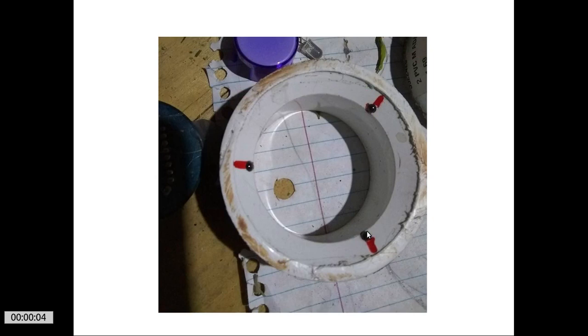There's a suspension. I found the proper size plumbing parts. And after trial and error, I found a size drill bit that the silicon nitride balls would fit tight. It was a nice tight friction fit, and I drilled the holes all the way through, pushed the balls in, and then backed them up with a piece of hot melt glue.